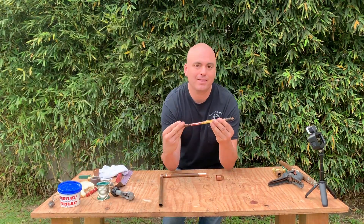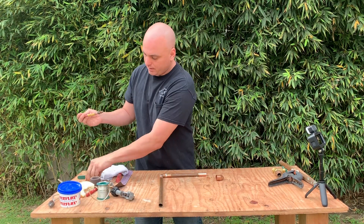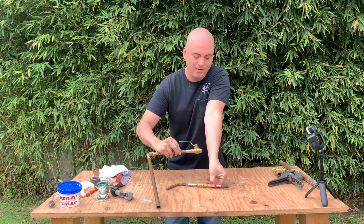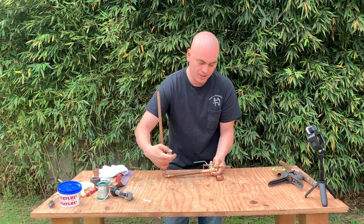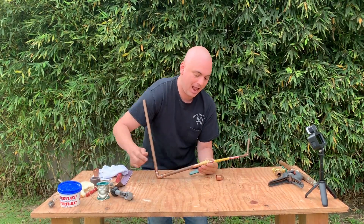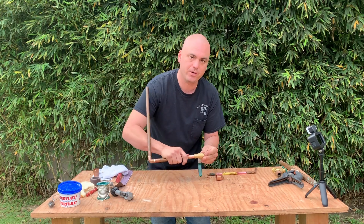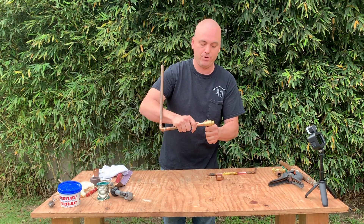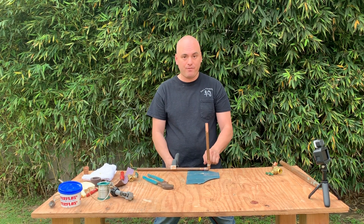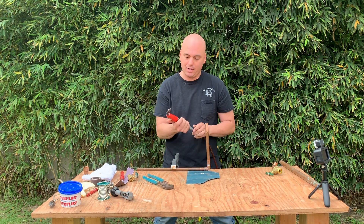You can also buy this thing called a Jet Sweat. It's basically a little rubber piece that you put in — usually with a ball valve like this. You would take that, put your ball valve in, and if water was coming down affecting your solder, you can add a ball valve, stick this thing in, tighten it up so the gasket expands, and then make your solder connection. Then you'd remove it and continue soldering. If you ever need to cut a pipe very close to a fitting, you can also desolder the joint.